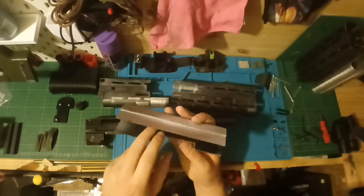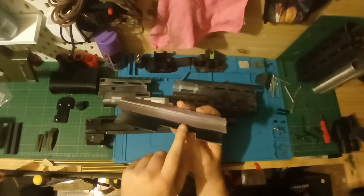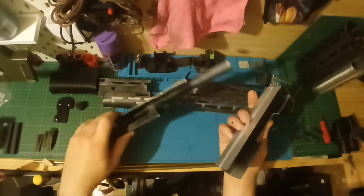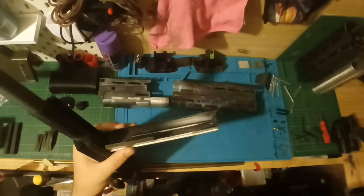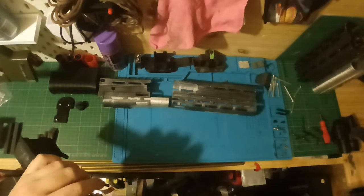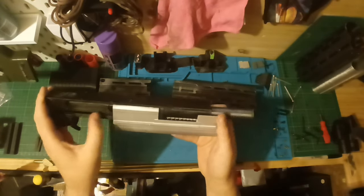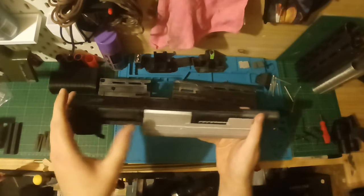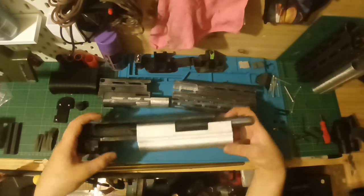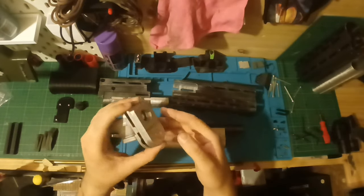For the internals you've got the outer barrel with a thinner inner barrel that comes into the bolt carrier assembly section. You've got the actual bolt carrier, the trigger attached to a firing pin. Then there's the part connected to the charging handle — made of two parts: the casing and a rod that's been screwed in, with a simple spring — not too strong, not too weak. You wouldn't want to use anything like an airsoft spring, they're too tough for this. There's a little groove where the spring sits. Once it lines in, that rod pushes back the bolt carrier, which opens the window to allow you to pop in the shell.